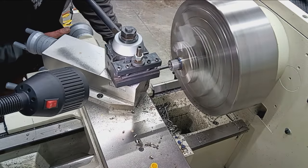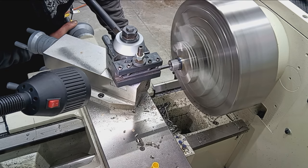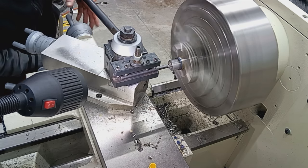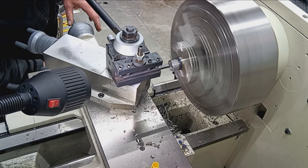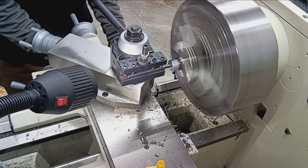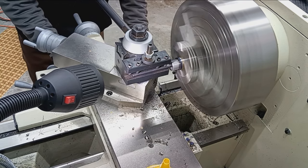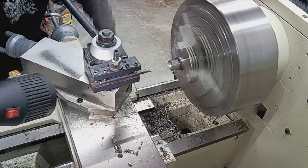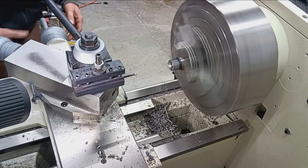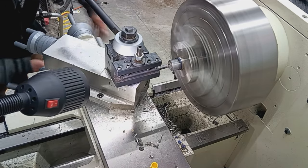Okay, let's pull up. Just touch off. There, and give it about 5/1000ths in feed, and take a pass. Up to zero, kill the feed, back out. Another fine feed, about 3 thousandths this time. With oil.